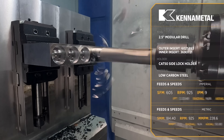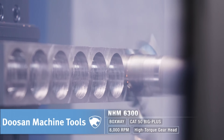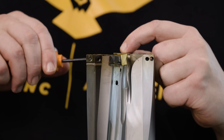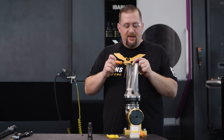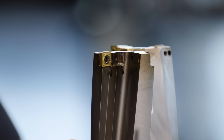You may have seen the video we did with the Godzilla drill. The cool thing about this tool is while the Godzilla drill only had two cutting edges and a center insert, this one actually has eight cutting edges plus a center insert. Now because we have so much more surface area in cut, this tool is going to require a lot more torque to push.